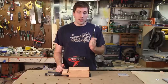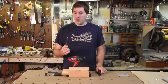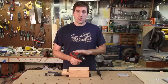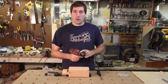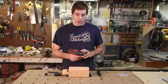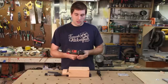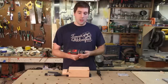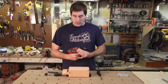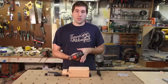Now, if you wanted to drive a screw by hand, you could use a screwdriver. If you wanted to drill a hole by hand, you could use a hand drill. However, most of us are going to reach for a cordless drill. This one and most of the ones on the market today are actually drill drivers. The difference between a drill and a drill driver is this clutch up top here. The clutch can be adjusted so that if you're driving a screw, it'll stop at a specific torque so that it doesn't overdrive the screw. Most of them can also be locked on a drill setting where it doesn't matter how much torque there is.